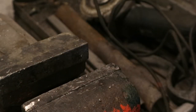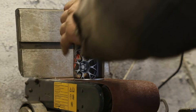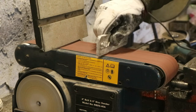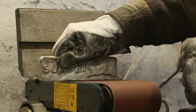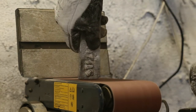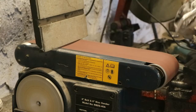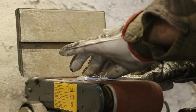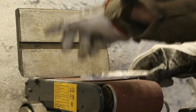The final finishing work will be done with the belt sander. The belt sander is not ideal for doing finishing work on aluminum, but this is what I've got. The sandpaper belt gets clogged very fast with aluminum pieces. When doing aluminum work, use a very coarse sandpaper. I think it's enough — let's call it a day and see the results.